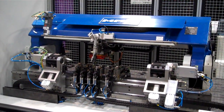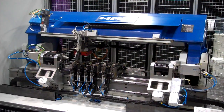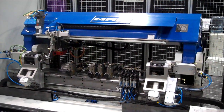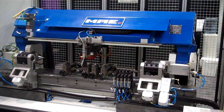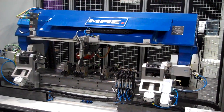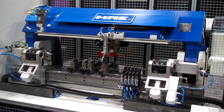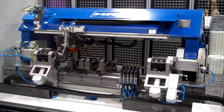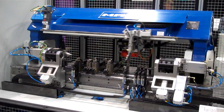It's using a laser to see where the equipment is. This can match any level of factory automation. Many manufacturers will have a full factory information system — their parts are individually marked. You can use laser scanners to read that part number, it enters into the computer, sets it up according to that part family, straightens it, reports the information, and sends it out. That information can be uploaded automatically to the factory information system on the floor.